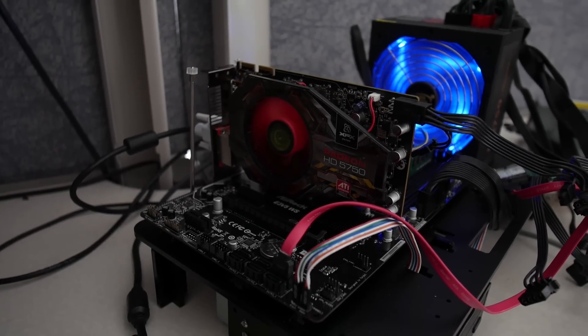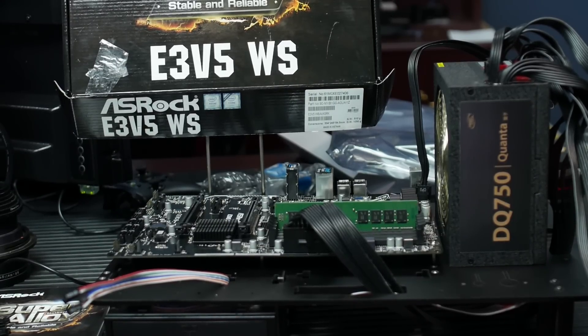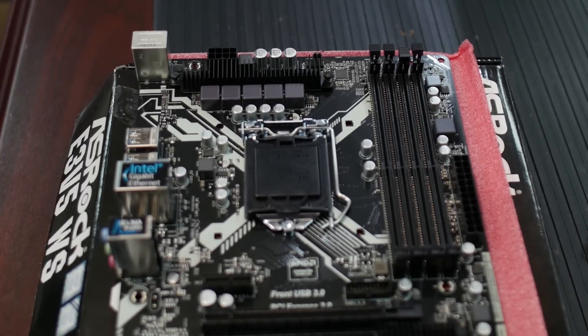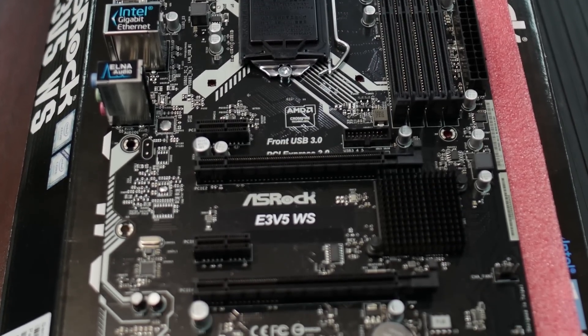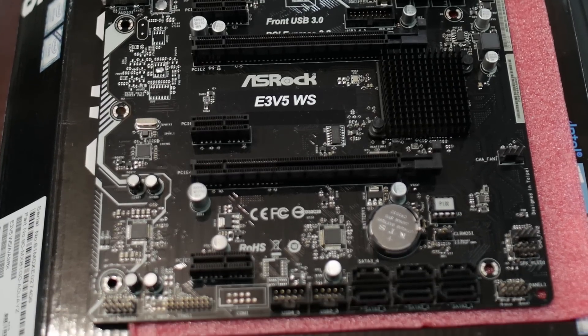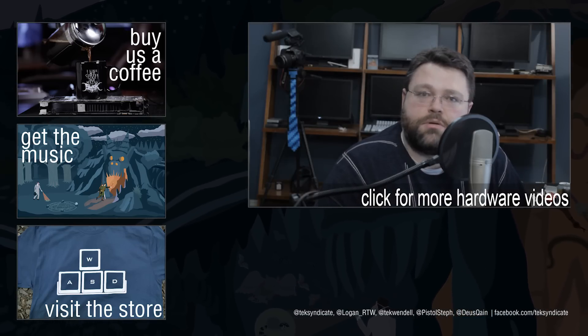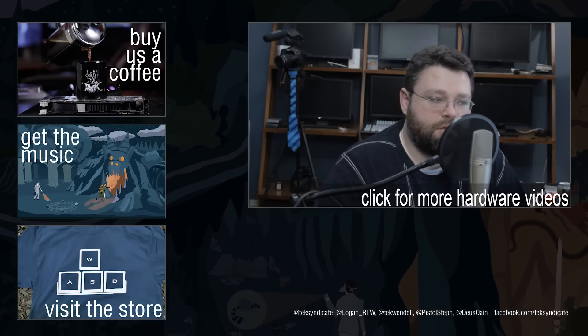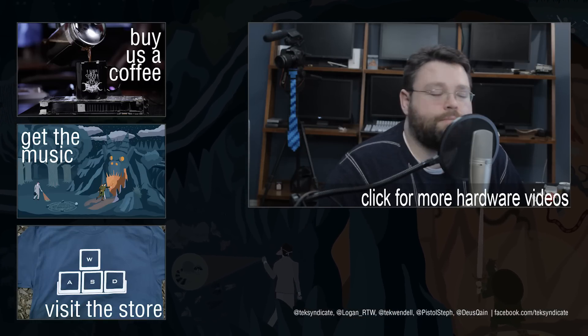After using this motherboard for a little while, I really like it. I like that the graphics card is always at x16 regardless, and the second x16 slot runs at x4 through the DMI interface, which helps lower the cost of materials. The layout is simplified with a reduced number of components. It uses ASRock Super Alloy components and seems built for durability and reliability. Instead of figuring out x8/x8 or x16/x0 configurations, this motherboard is always x16 and the second slot is always x4 — that's really its best feature. It's a simple, no-nonsense workstation board that makes a lot of sense for video production or any build based around a Xeon CPU and error-correcting memory. Overall, I like it.